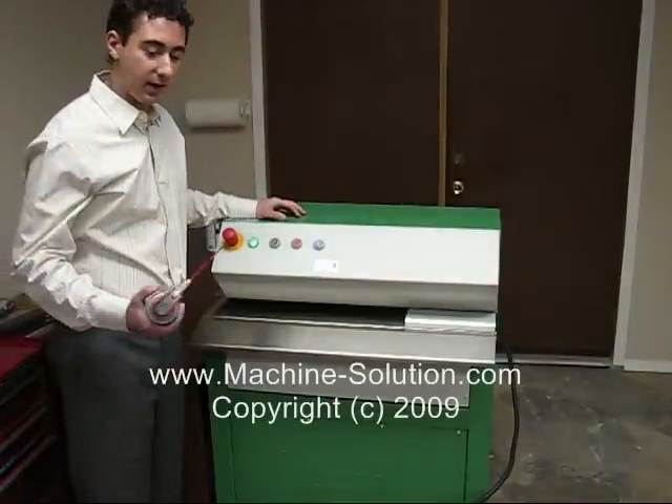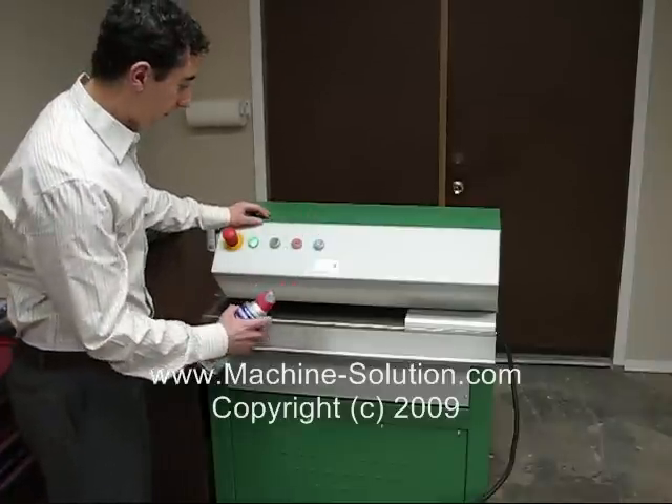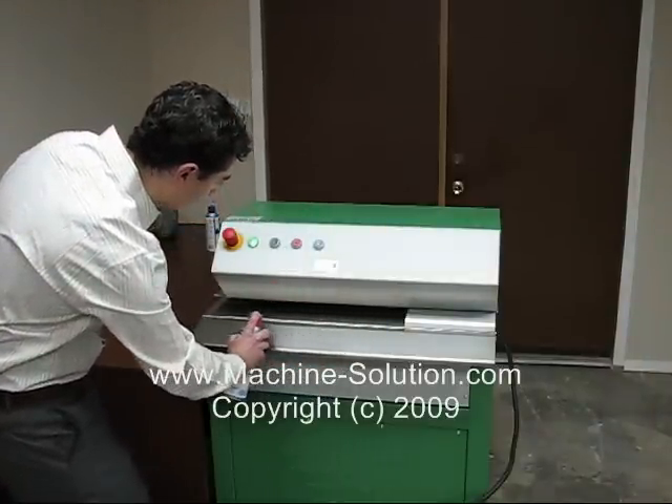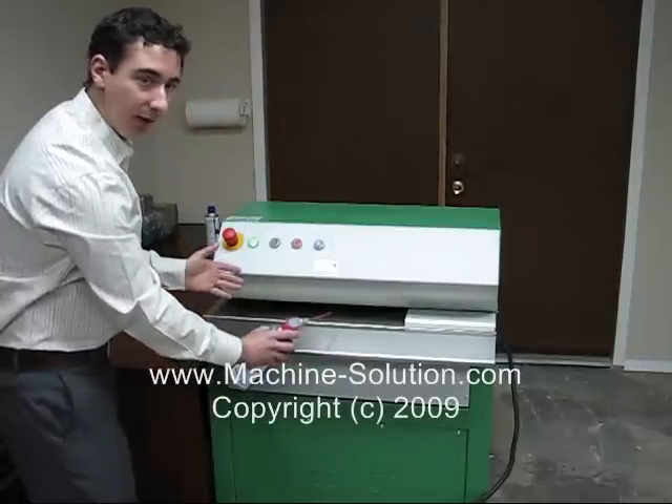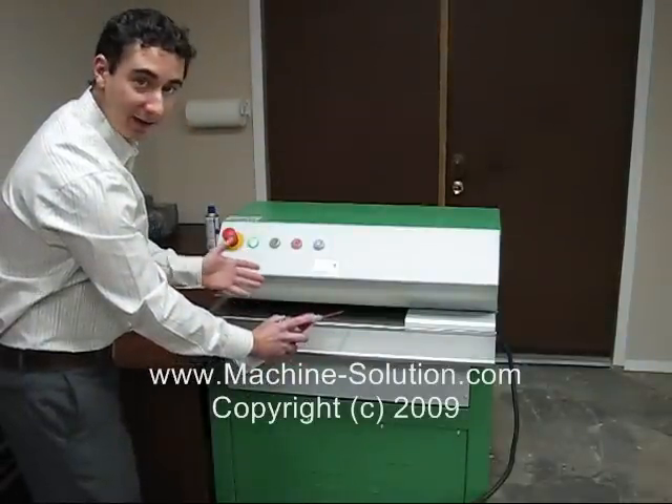If you begin each day, you use a can of WD-40, and you want to spray across the width of the cutting cylinders while the machine is running. This will help clear up any debris, and it helps clean the cutting cylinders.